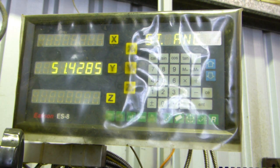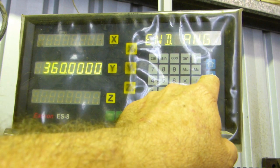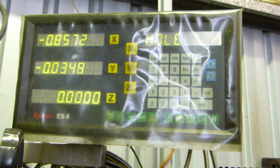The first angle, now, if you divide 360 degrees, which is a full circle, by 7, it says 51.4285, which is right, I think, because 6 into 360 is 60 degrees. So to fit another one in, we'd have to drop back there. So our first hole would be 51.42. Our finishing hole would be at 360 degrees. That's the rest of the circle. And so there we go. If we zero the hole out here, that one, and we'll zero the other one.